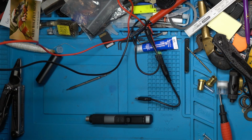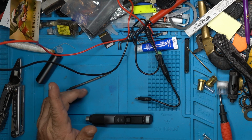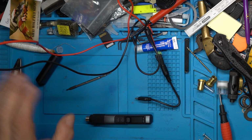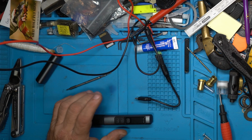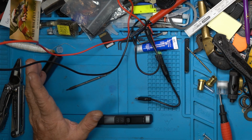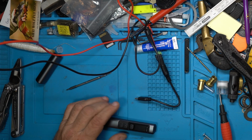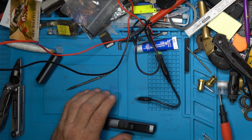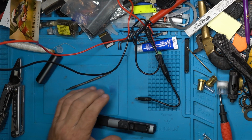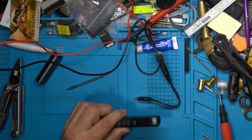To give you backstory on the power supply I've been using, it is a GaN style 265 watt, 5 channel output power supply. Supposedly it does 3 amps at 20 volts. If it really did that, then this iron would start up with it with no problems. So apparently it's not even doing that. I'm going to try to set the amperage on this benchtop power supply lower and lower until I see the lowest amperage that this is going to start up with.